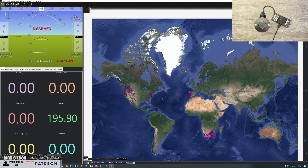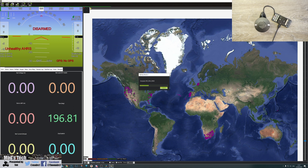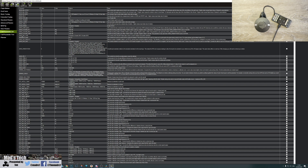So now we're going to configure the autopilot. There are four settings we need to change: first, enabling the CAN bus ports; second, telling the autopilot we're using a CAN-based GPS; third, enabling the CAN-based LEDs; and fourth, doing the compass configuration. To enable the CAN drivers, connect your autopilot to the computer - you can see I have the CAN GPS already plugged into the middle port, which is CAN 1. Now go into Config, go into the Params list, and the first thing we need to do is enable the CAN port.